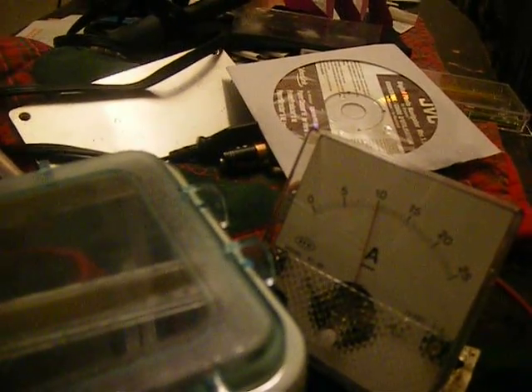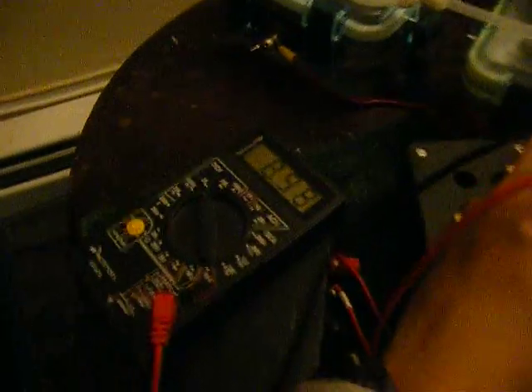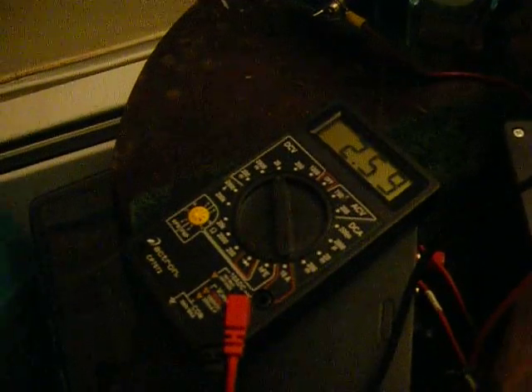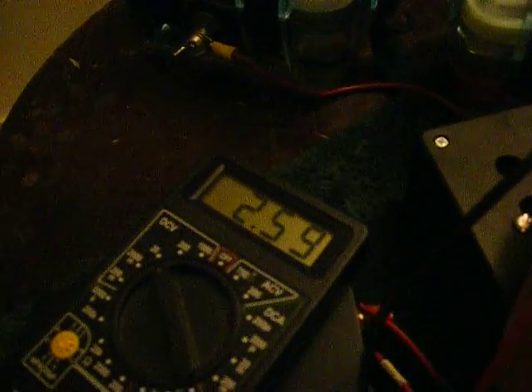So let's crack this up to 10 amps. Total production still blows. Inside this box is my 25-amp unit. Obviously these two cells closely match running in parallel, so that would be about 12 or so amps a pop. Now these cells are room temperature — I didn't even pour hot water. Speaking of which, potassium hydroxide, and I have a DuPont four-stage water filter. We're pulling double the amperage at 10 amps, and we've only increased our voltage negligibly — it's still 2.6 volts.